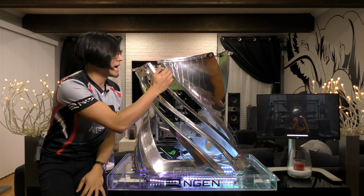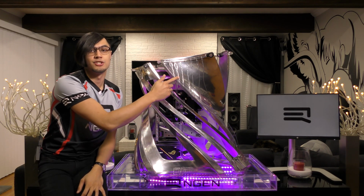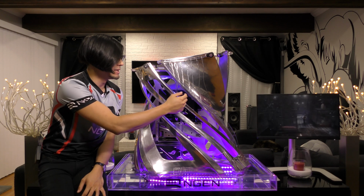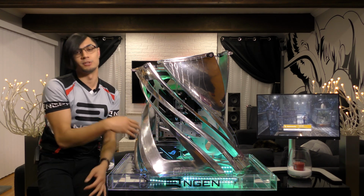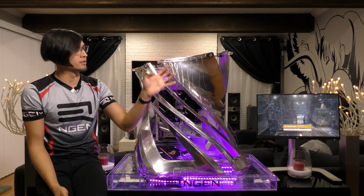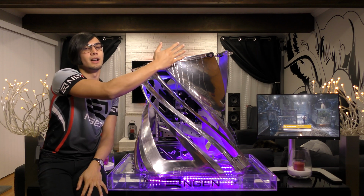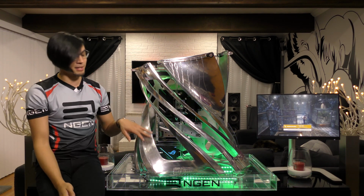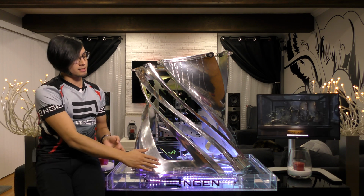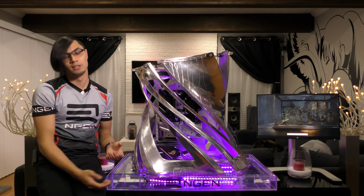One big thing that has to happen is water has to catch in this channel. If it were to drip over the edge, it hits the section, splatters, and then splashes and coats everything, which again could cause a short. So to prevent that splashing, we have to catch it when it runs down. So the jets do shoot onto this, and then of course it stays on there just via surface tension, hits this, flows down, and by the time it gets to the bottom here, any splashes, if there are, which there really aren't any, are super minor and they're away from the computer, keeping it safe.